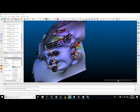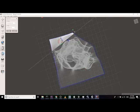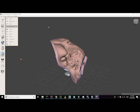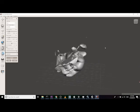By combining the best scans together and saving it as an STL, and bringing it into MeshMixer, cutting away some of the sheet, you see that when it exported, some of the surface normals were pointing inwards, and so by making this a solid, we can get rid of that problem. And so here's what it looks like.